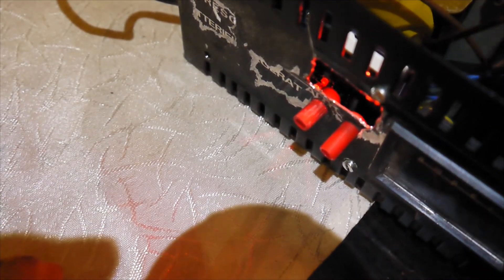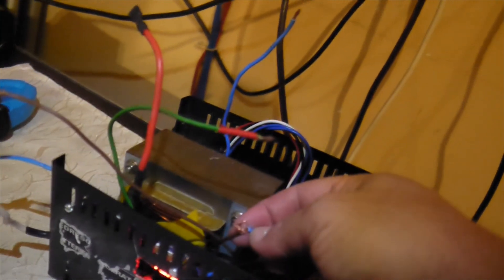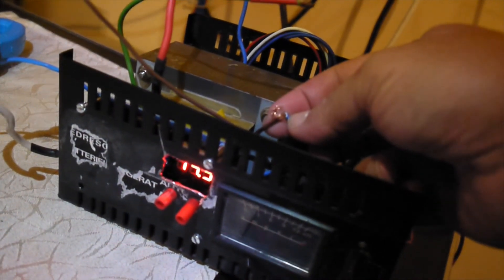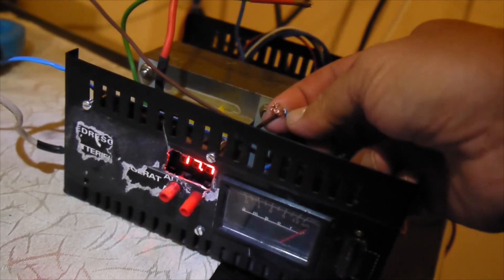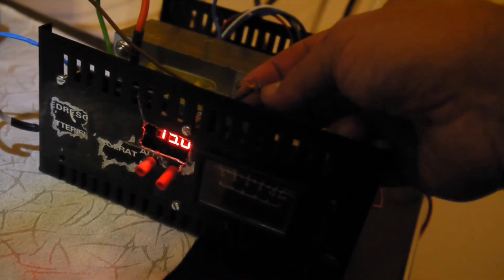At the moment it shows six amps, but if I switch to a different coil tap with a better voltage — look at that — it goes to more than 12 amps. That's exactly what I was looking for, because if I need a fast charge I can switch to that tap, and I can even use it for revival, you know, bringing an old battery back to life.